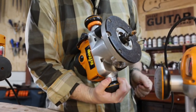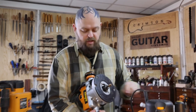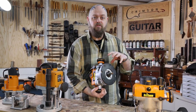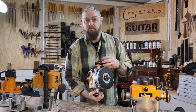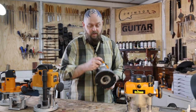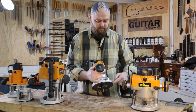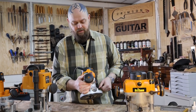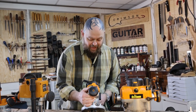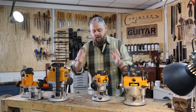I can change that cutter externally — it is literal genius, and it is for this reason that I will never use another router. On top of that, if you've got a built-in collet lock like this, surely you run the risk of turning the router on and destroying everything. If you turn this on while it's locked you're going to strip the motor out. Not so — they've designed it so that when your collet is locked in place, your clear plastic switch guard is locked in place too, and you can't turn the router on. Move it down and that moves again. Absolute genius.